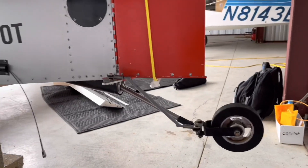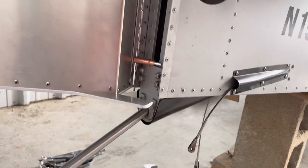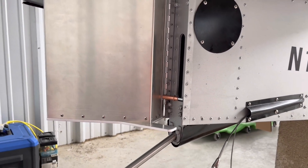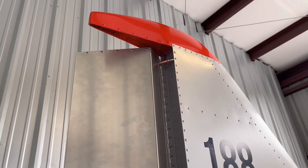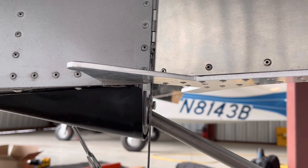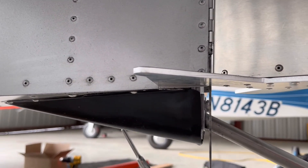That may change the geometry a little bit. I have the new rudder just provisionally fitted in place — there's a CLECO on top and bottom just kind of holding things, and we're just trying to confirm that everything is at the appropriate level. This is a little challenging because we can't take the rudder through a range of motion since those CLECOs will bind. You can see here that the control horn is at the same level as the beginning of the fuselage, which is what it shows in the plans.